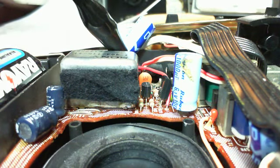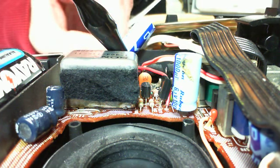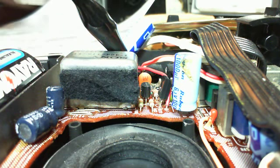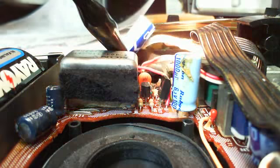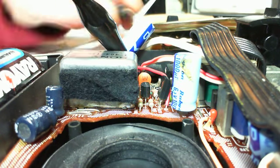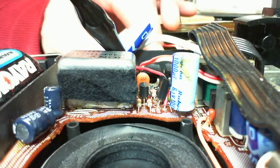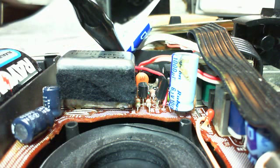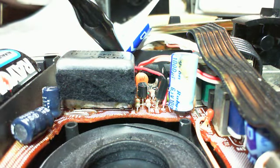Oh yeah, so we were going to check this jack, this timer jack. I guess we test it by just plugging something in and out of it a few times. Okay, timer jack. So we've got DC in. The next one is a timer. So this is the timer jack right here. No obvious change in the radio's operation. Nothing changed there, I don't think. Reading the same output voltages. Or input voltages, really, that's what we're reading.